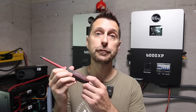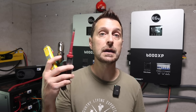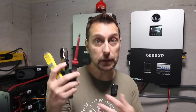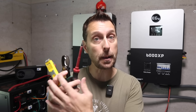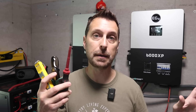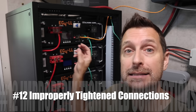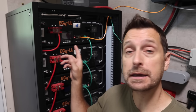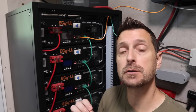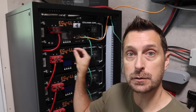These tools from Harbor Freight are not that expensive, and when you are DIYing your own system, adding the proper tools compared to all the money you're spending on components is not going to be that much at all. Another mistake is not tightening connections down properly — loose connections are dangerous and you need to check those periodically over time because there's expansion and contraction within wires.